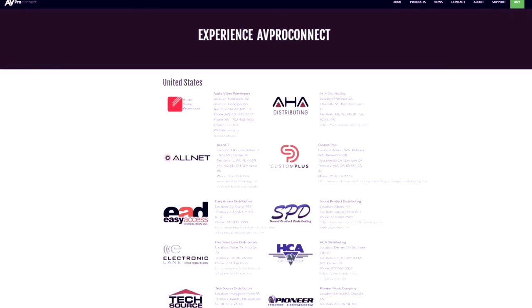Okay, so the question was, when you're testing HDCP 2.2, what do you do with the generator and what do you do with the analyzer? So let's talk about that. If you put the generator into HDCP 2.2 mode, that means the signal it's outputting will be HDCP 2.2. It can accompany a 1080p signal or a 4K signal or whatever, but normally that's used with 4K.